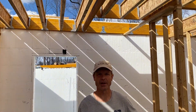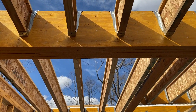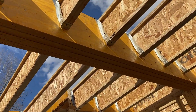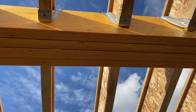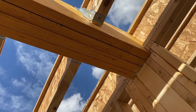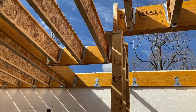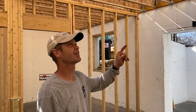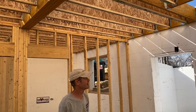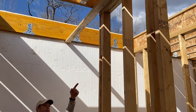I want to point out the beam above my head. I have a lot of respect for builders who do things the old-fashioned way and by hand — this is a very heavy beam, but it was put in place by hand. He did an excellent job; it lined up perfectly. Good craftsmanship. You don't need a bunch of heavy equipment — we even have a video on YouTube about that. Here in this center area is the open expanse that requires that beam, and the floor joists tie into it. This opening here is the stairwell, which is going to be a winder that goes around and up to the second floor.